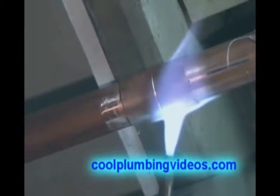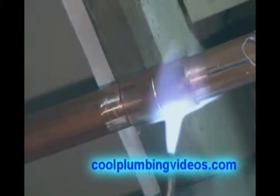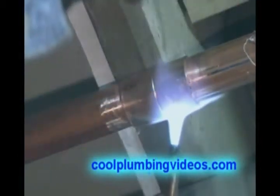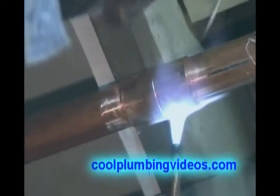Now this is an overhead soldered three-quarter inch coupling and three-quarter inch pipe. If you can kind of see the reflection of the solder in the pipe, you see that I have a hook on the end of it. I always pull it out and put a hook on the end so that we can reach over to the side that we can't see.